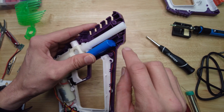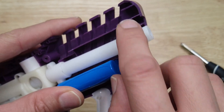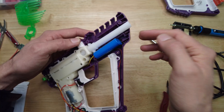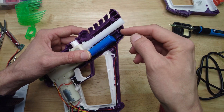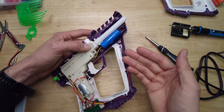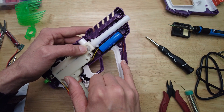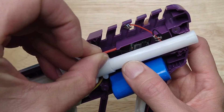To make this mod really simple I'm going to use the wires that go to the contacts in the front, because this provides five volts that turns off automatically when the blaster goes into standby, so it's going to save electricity. I have yet to see any accessories that use those electrical contacts, but if you want your blaster to be future-proof you could solder additional wires to those contacts or tap into these wires. There's actually plenty of space for the circuit board to live right next to the barrel inside there.